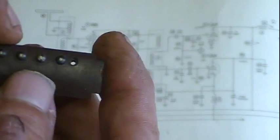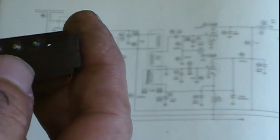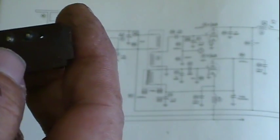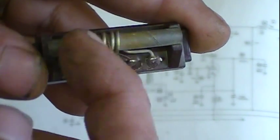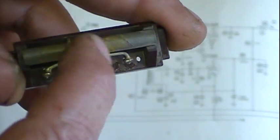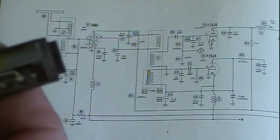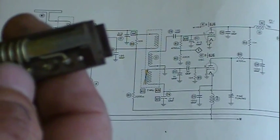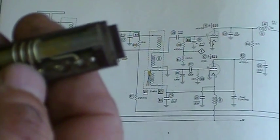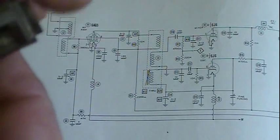You could, but there are other types of tuners, wafer switch tuners, kind of like you see a band switch in a shortwave radio. They're just little wafer switches, and the coils would be out in the open. They're air coils anyway. There's nothing inside; it's just a plastic form or cardboard tube form. But the coils in those types of tuners are just out in the open. If you're really lucky, in some of the later sets that use that style, they put a little sponge rubber-like stuff inside the coil, and once it was tuned, embedded it in wax over the coil and the sponge, which gave it some strength. But if you bumped it hard enough, you'd still move that coil.